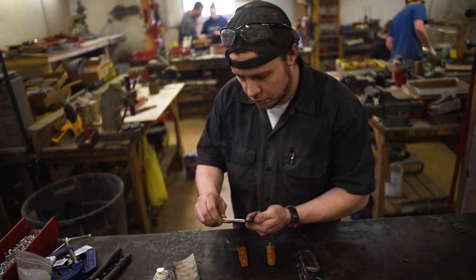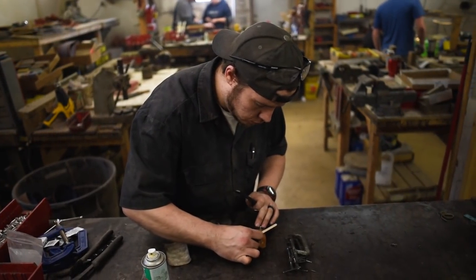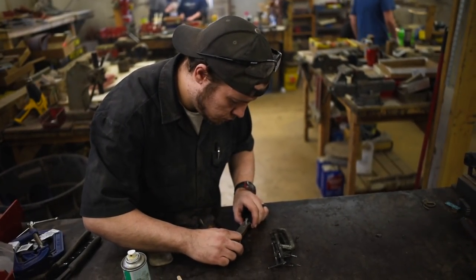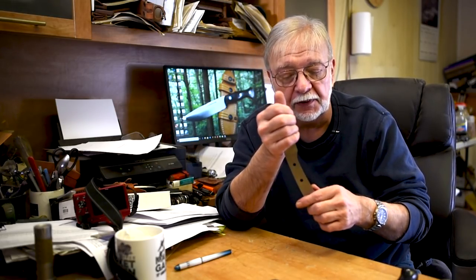The next step is the blade goes over to the assembly table, where the crew puts the handles on — whether they be pre-made, partially shaped 80% shaped, or just blocks of wood or micarta if it's not a pre-shaped handle. They spray it with epoxy. On the slab handles we use a two-part spray with an activator. On the hidden tang handles we use regular two-part epoxy mixed 50/50, poured down on the tang when they assemble and then slide the knife over the hidden tang.